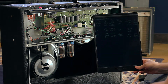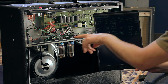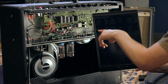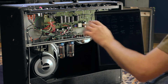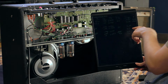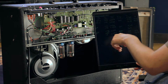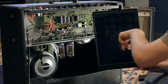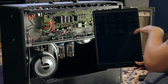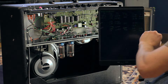So what I ended up doing was going up a little higher. I took the millivolt reading at a couple of different higher points and got my voltage drop. This one is at 75 millivolts and 81 millivolts at the Fender test point. At 75 millivolts, we ended up running about 15 to 16 watts dissipation — about 50 percent. At 81 millivolts, we ended up running right around 17 watts, so between 56 and 58 percent.